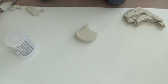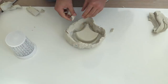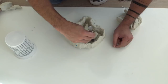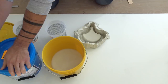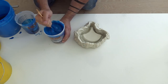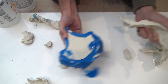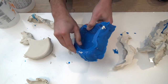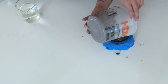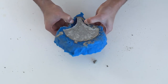I used a butter knife to smooth over the edges and cut the clay where needed. If you want to make really big pavers, you could try using some cake pans to outline the shape. I used the same clay to make a dam around the paver shape and then mixed and poured some more Moldstar 30 into the clay. The clay doesn't stick to the silicone and just pops right out. This technique worked great for making a mold for one paver, but that would be a lot of concrete pours to get to anything sizable.